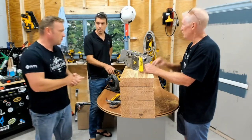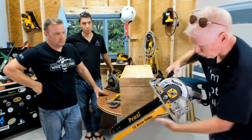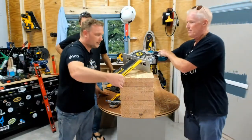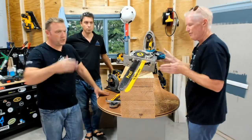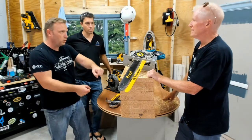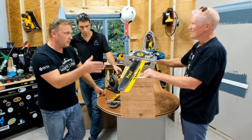When I'm using it there's no exposed chain to your body — the chain is totally protected, there's no kickback. Does this also act as a kind of guide? It's a guide — helps maintain a straight line. Because when you try to cut with a chainsaw you're kind of at the mercy of your wrist. Something like this will help keep that edge nice and straight.